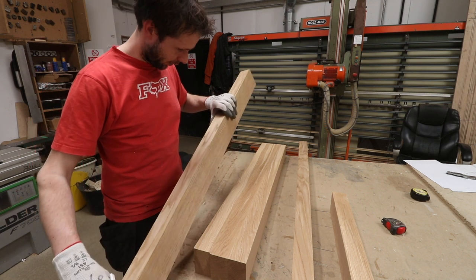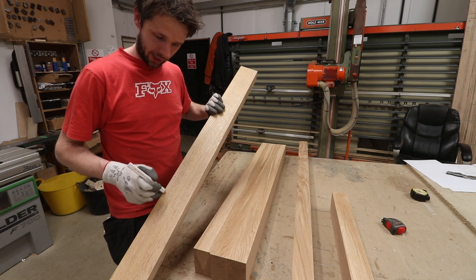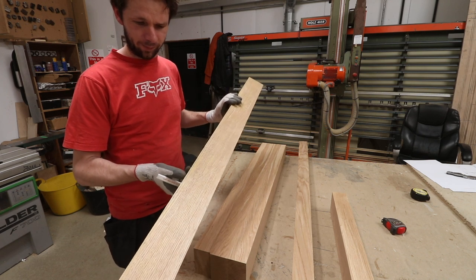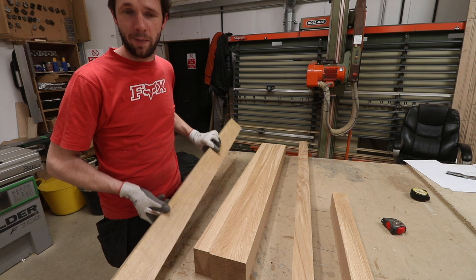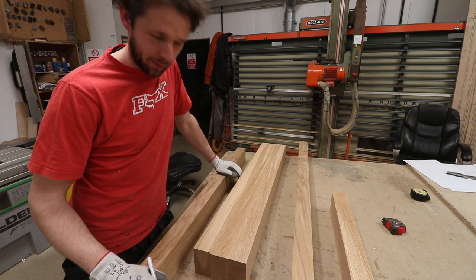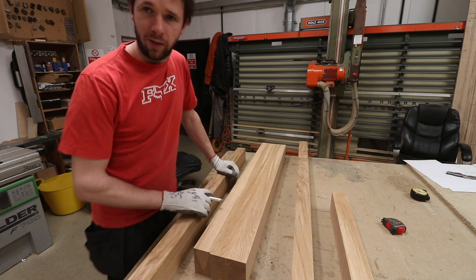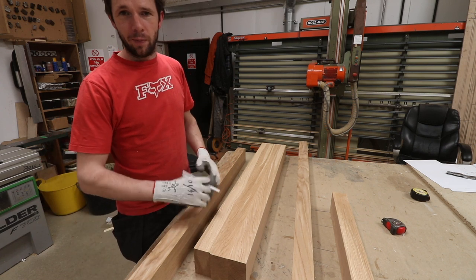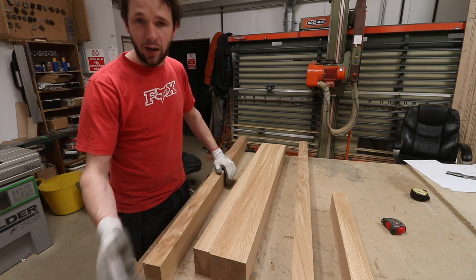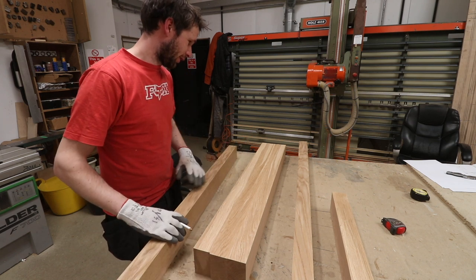And they can splay across from the corners, and it looks like it's attached, but you'll have a line on it like this, and they're quite nasty. As soon as you put a machine into them to rebate it or anything like that, they tend to split away and then show themselves up. So if you can find them in the timber, if there is any, mark them out, and we'll try and disguise them on the back or the edge of the timber where nothing's ever going to be seen. It'll be in either the brickwork or in the plasterwork. So that's the best way to deal with them.